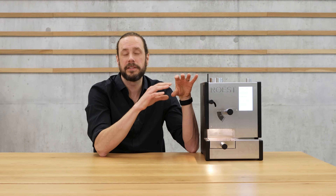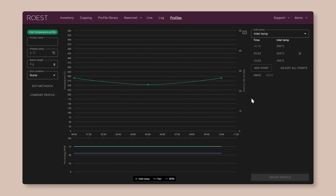The way you control your roast is profile-based: you select a sensor, draw a roasting profile against it, and the machine follows that profile. What's also nice about this version is that it has a between-the-batch protocol — a special roasting profile that guides the machine from the end of one roast to the beginning of the next. This ensures the same temperature and the same thermal momentum when starting the next roast, giving you really nice consistency roast over roast.